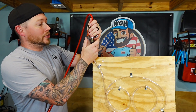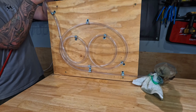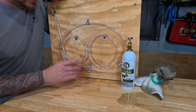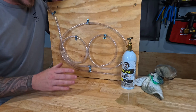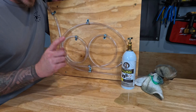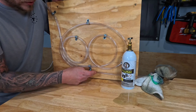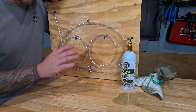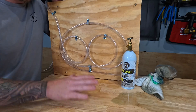Final blast of nitrogen in three, two, one. Now that we've completed the final purge after the flush kit, you can tell that everything has been removed from the line set itself — all of the dark oil, all the stuff that was built up in there and wouldn't get out of these oil traps is 100% gone. You can see just a little bit of the flush chemical still in the oil traps, but don't worry — that can stay in there because it will boil off in the vacuum and flush 100% out of the system.